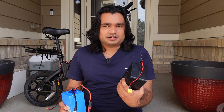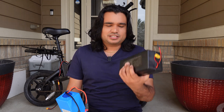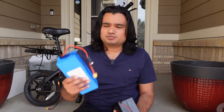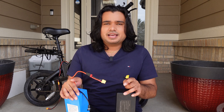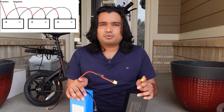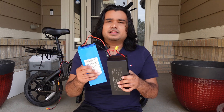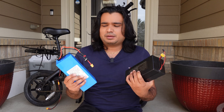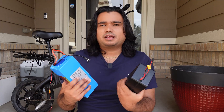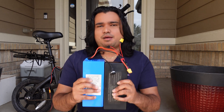Let's talk about the parallel connection. These two batteries are both 36-volt batteries, but that does not mean they are just 36 volts. This one at full charge is about 42 volts and this one at full charge is about 43 volts. When you talk about parallel battery connection, you are connecting the negative pole to the negative pole and the positive pole to the positive pole, giving you one giant battery. The voltage does not go up — you still end up with the same voltage — but your capacity goes up, which is the amp hour. This is 6 amp hour and this is 10 amp hour, so when you connect them together it becomes a 16 amp hour battery.